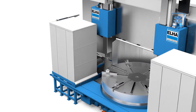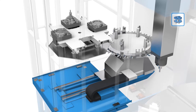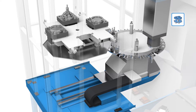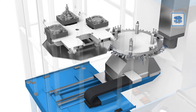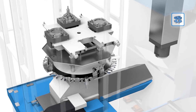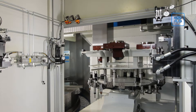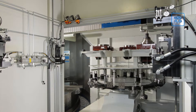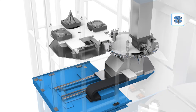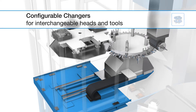A VTM can be equipped with various head and tool change systems. As an example, we present a compact retractable system with two layers. The top layer, with several head units, can be decoupled from the tool changer. The lower tool layer can be configured with various tool holders, both for vertical and for horizontal tools. LH offers a broad range of holders for turning operations, as well as head units for milling, drilling, and tapping operations. The tool change system is configured to customer demand for your big tasks.